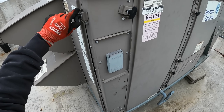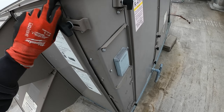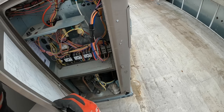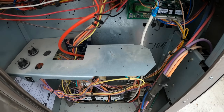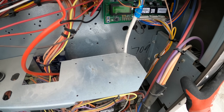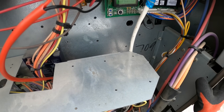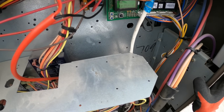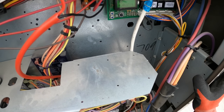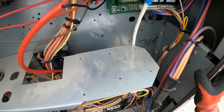It makes sense — for an elevator mechanical room you don't need heating, it's straight cooling. The fault codes show: number four is a humidity sensor failure, and number five is an indoor air quality sensor failure.